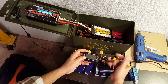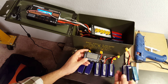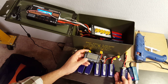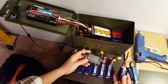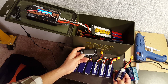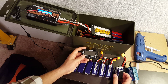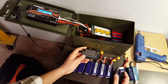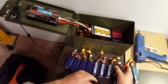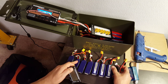The reason is that the 3S is going to be at around 12 volts and the 4S is going to be at 16 volts. When you have two voltage sources in parallel, one's going to feed current into the other until the voltage is equalized. If you plug a 3S and a 4S battery in parallel with each other, the 3S is going to catch fire — probably. It's not going to be pretty. All of the batteries need to be the same cell count: 3S, 4S, 6S, whatever.